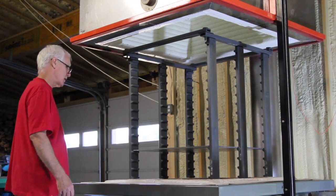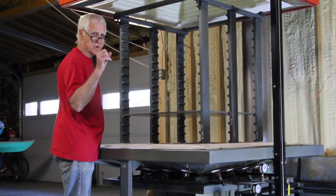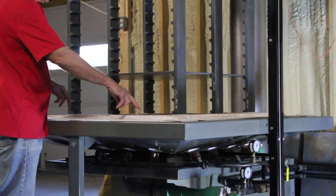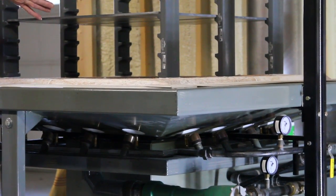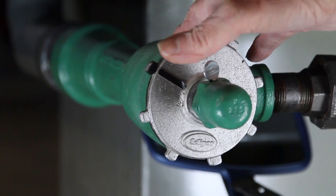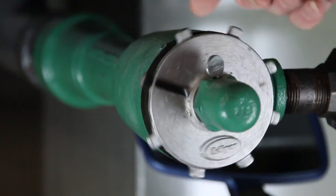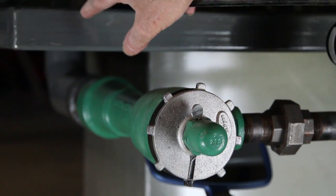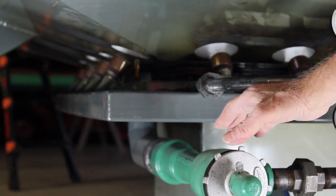The kiln is fired with 16 burner ports, using one burner mixer firing all 16 ports. There are four ports on each side and the ports are angled so they flare the flame against the fiber wall. This kiln fires with one single burner, one single mixer. This is the primary air on the mixer right here, and it feeds into a manifold common to all 16 burner nozzles, so you can make all air-fuel settings at one source and it affects all 16 burners.